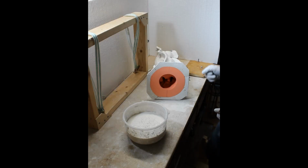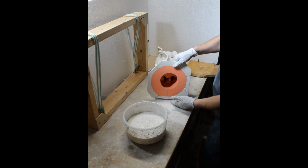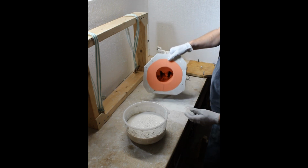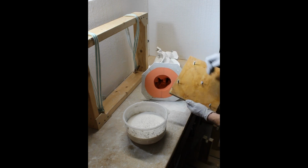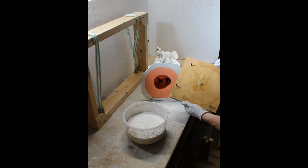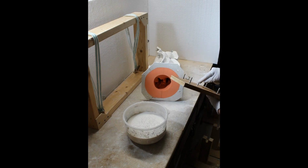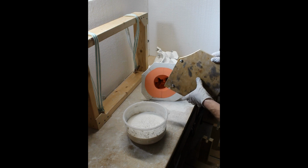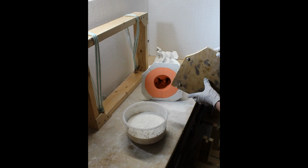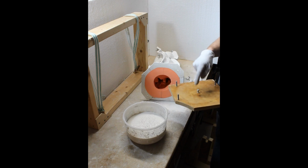Okay, so I just want to give you a rundown really quick of what's going to go down, how it's going to happen. This is my mold. Here's the bottom. I have this board covered with Vaseline, soaked with Vaseline. Then I have a 1 1/4 inch bolt, 1/4 inch, right? It's in there, so that's ready to go. That's going to be for the base after this is cast. So in theory that should sit around there.